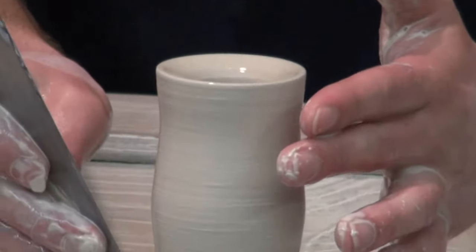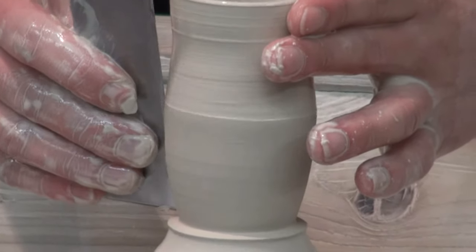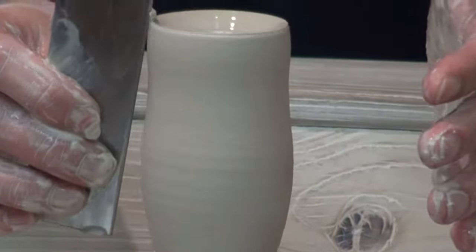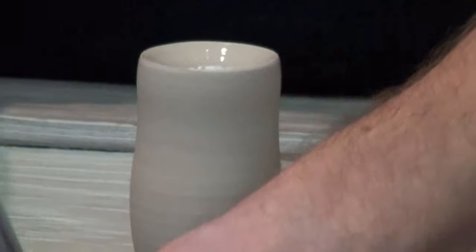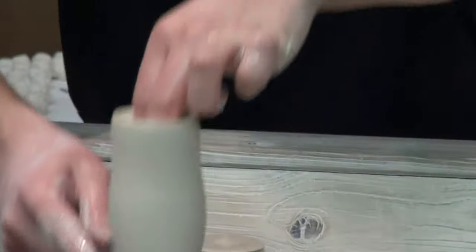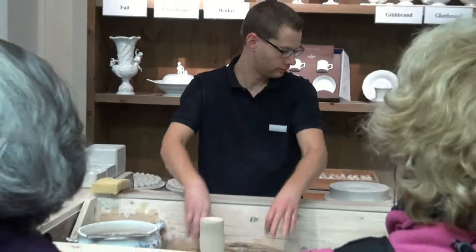It's either made hollow or full inside. Under the diligent hands of this worker, the blank is taking shape. A thin layer of semi-liquid porcelain slip is being removed with a piece of metal. Cut off from the rest of the paste, the blank is now ready for molding.